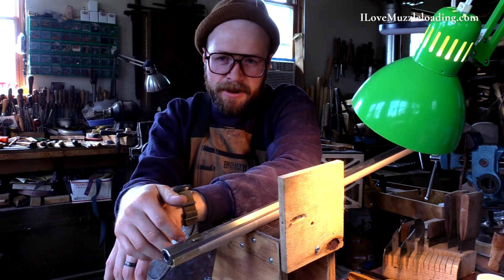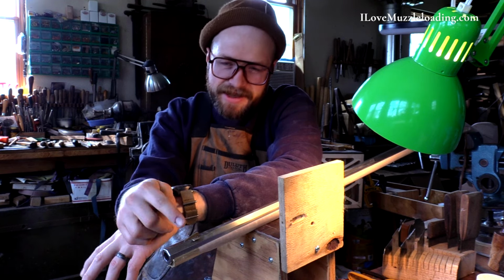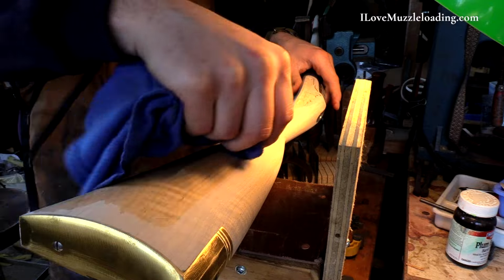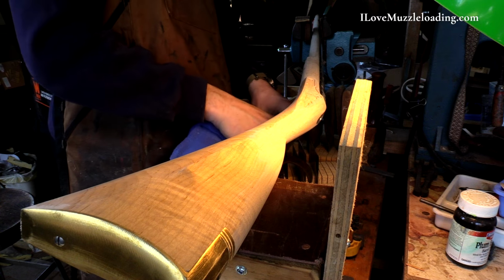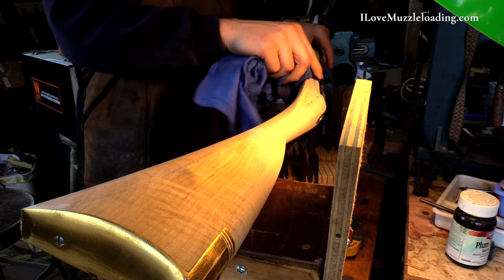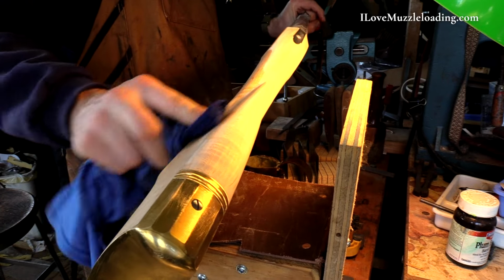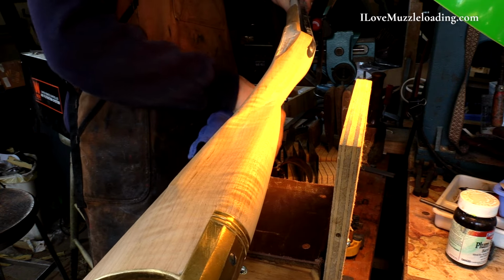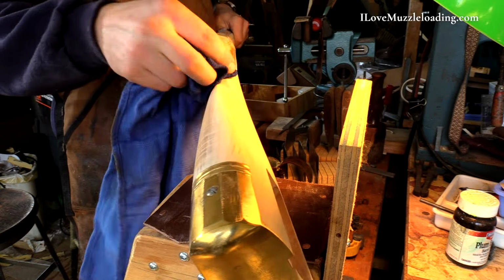I fully attached our nose cap, and it's not done, so it doesn't have any solution or anything on it. It's not very smart on my part. We can still sand and polish it in place where it's at. We might have to get a little creative on the brass finish, though. I was watching Peter Kelly's video on doing his Woodsrunner. He talked about using black powder fouling to age brass on his. I'm thinking we might be able to prematurely age our nose cap on the stock with some black powder fouling, because it's going to get some of that grime and nastiness anyway in time. So it might be an easy way for us to still finish out our nose cap after we've a little bit foolishly mounted it to the stock.